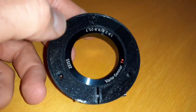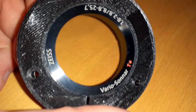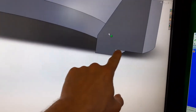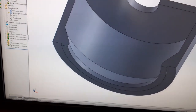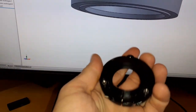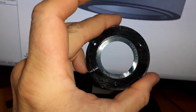If you apply pressure on this very thin metal you can easily make things worse — you can bring additional dents in. So what I'm doing now is designing a little part that should only apply pressure with a small corner, and it will apply that pressure all around. With this thing I will simply push into the cylinder, hoping that by bending the entire thing, everything will smoothly and evenly come out.